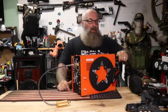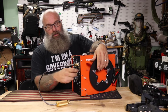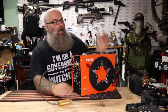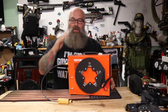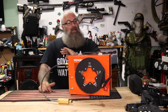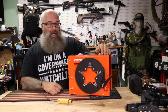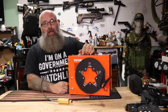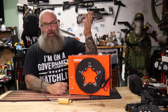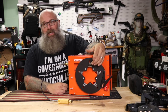You also have your typical bleed valve — you crack that open, all your air bleeds out, and then your line is safe to disconnect. I want to say thank you to Vever for trusting me to review this. Honestly, this one is right up there with any other high-end compressor I've had. It functions perfectly — I've had zero issues pumping up air guns to 4500 PSI, 300 bar, or anything lower. It just chugs along and doesn't give me any hiccups.